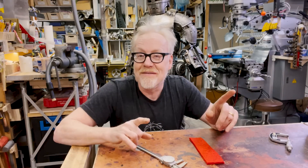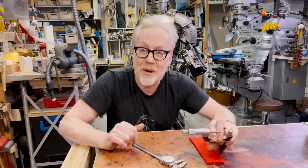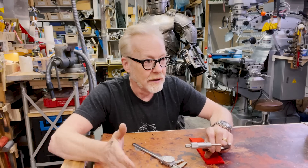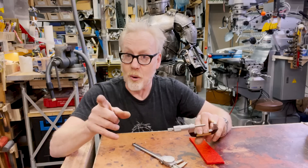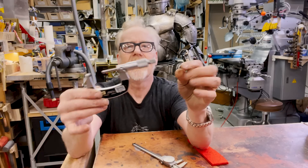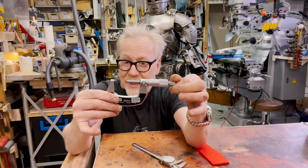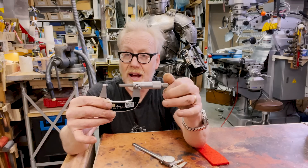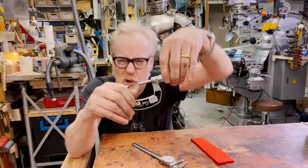If you haven't watched my video about making the case for my Mitutoyo micrometers, please do. It's a lovely video — a box that I modified for the collection that allows me to measure plus or minus about less than half a thousandth from zero to twelve inches. If you haven't watched that, go watch it. But even if you've watched it, I just want to cover one thing. These types of barrel micrometers have up here a ratcheting head. You hear that? And so what that head does is the ratchet allows you to apply a constant amount of force.